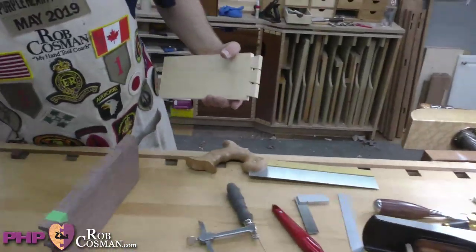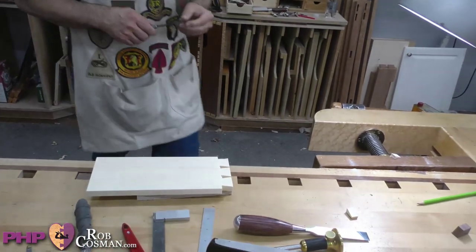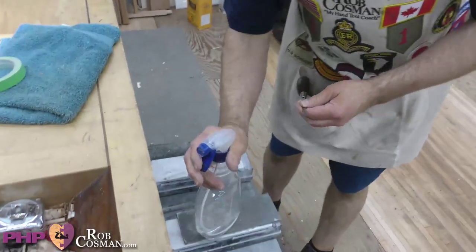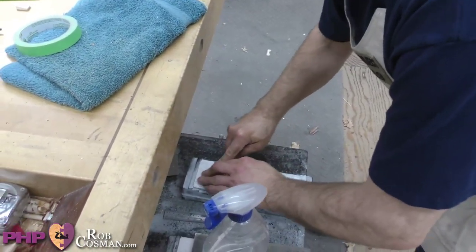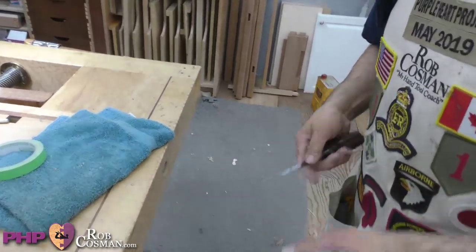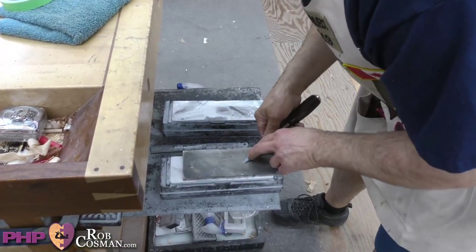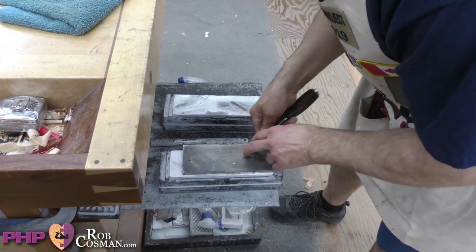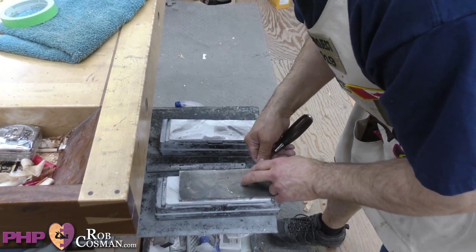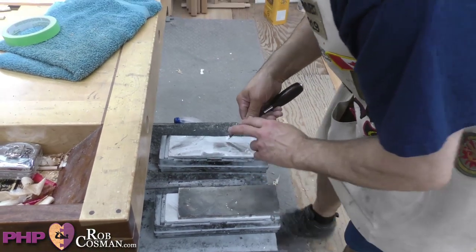Okay. Now, get a piece of scrap to rest the references on. It's aspen, so I'm going to use my 17 degree. Huh? Why? I apologize if you've already heard this a dozen times, but in dealing with softer woods, whether it be aspen, pine, poplar, alder, the problem that you encounter is the fibers fracture so easy. So what I discovered is that if you ground the primary bevel back to make it extremely acute, in this case 17 degrees, that was just through experimentation, you'll find that it'll slide through those woods without crushing the fiber and just leaves you a perfect surface.